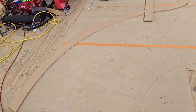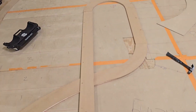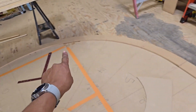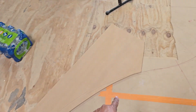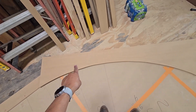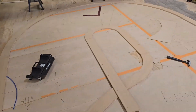On the inside stringer I got the top plate all the way to the last step. It starts, wraps around, comes back over the first step, and ends right there. The outside one comes out with a perfect radius, but here is where it's taking me a while — it used to be a perfect six-foot radius, but because of that wall that's out of whack at the job site I have to adjust. So I gotta fix that here and that's gonna take me a while. I'm gonna go get lunch, but it's starting to come together.